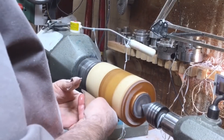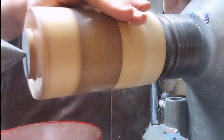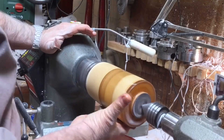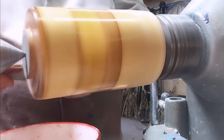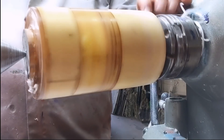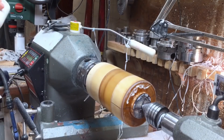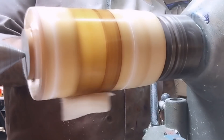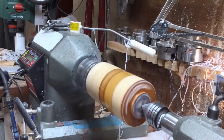I'm polishing the resin now — wet sanding with the normal pad, the fine pad, the extra fine pad, and the micro pad, all with water. I'm trying to use it only on the area where I have the resin. Then I'll move to Novus — the three to one, or just the three and two — heavy scratches and light scratches — and work it up to a full polish on this side. I want to finish one side completely before continuing, because it will be difficult to do later.